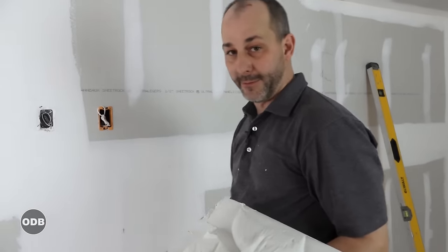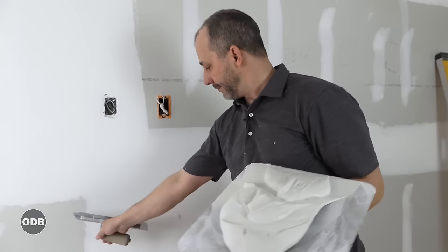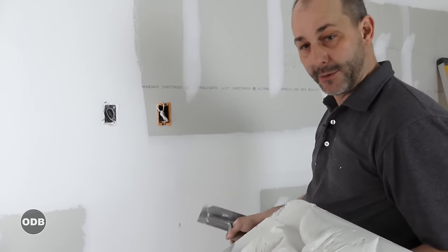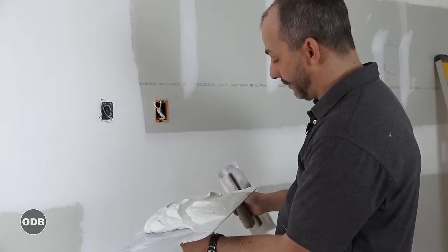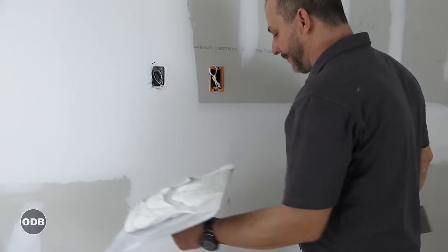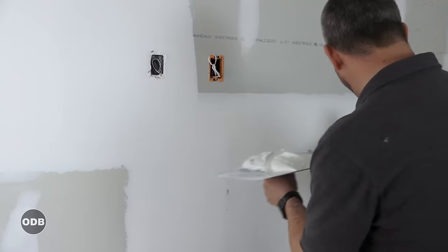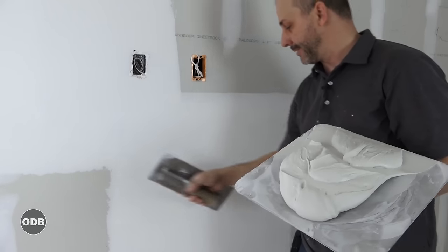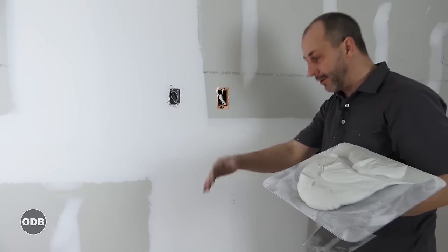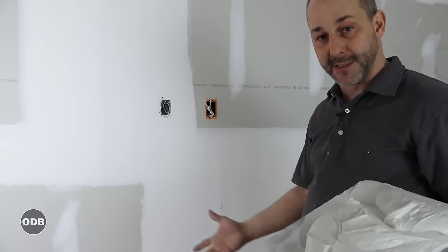This is why we have to make it nice and wide. When you look at a wall, you can only focus in about a three to four foot diameter. If your bump goes from zero to the height of the bump and back to zero, you'll notice that ridge because you're able to focus on it inside that area. If I stretch that same depth over a larger area, now you can't focus on the change because you have to look left and then right to see where it went from zero to ridge and back again. All we're doing is stretching the light over a larger surface area for the same ridge depth so that it's invisible to the eye.